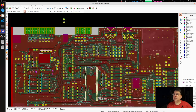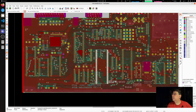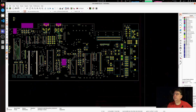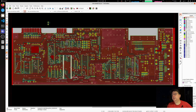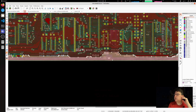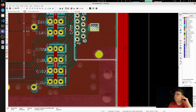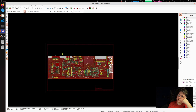So what have I been doing? Well I've been doing the layout. Look, it's almost done. I'm going to turn off the bottom layer — just the top layer here. The top layer is almost done. The bottom layer doesn't have much: a few ones over here and some over there. I've been doing all the fill layers — I think that's what's new. I've done them in sections and if I do it in sections it's easier, so I just overlap. The next one just overlaps the previous one, because that's easier than doing one full net.